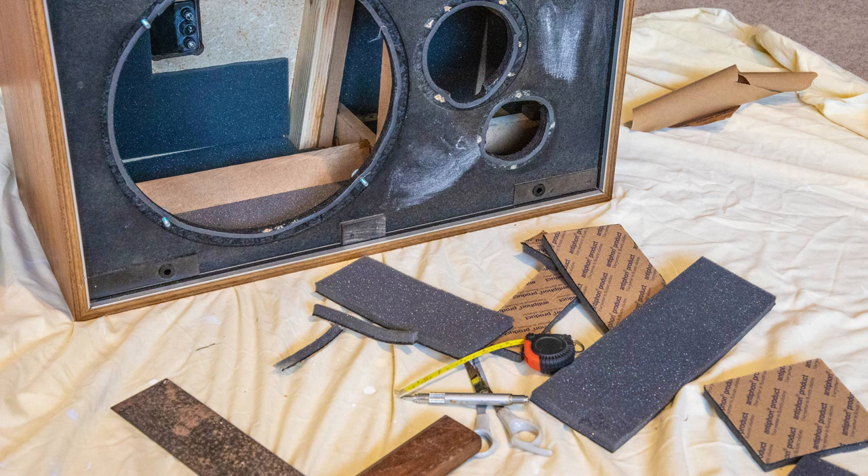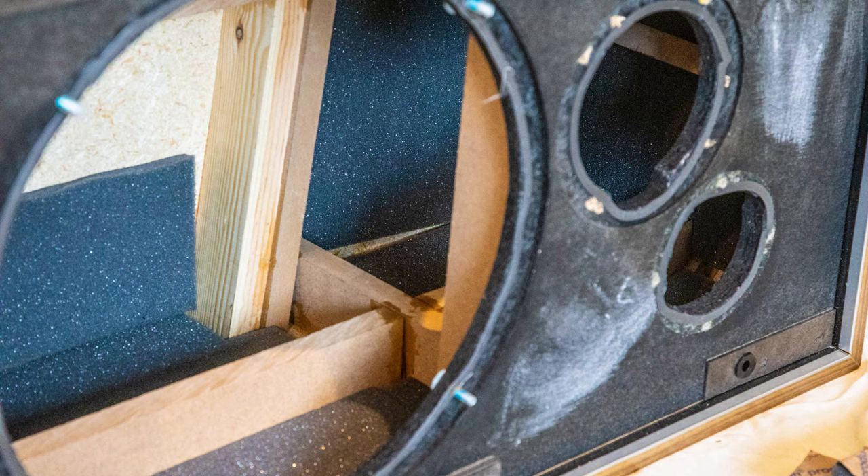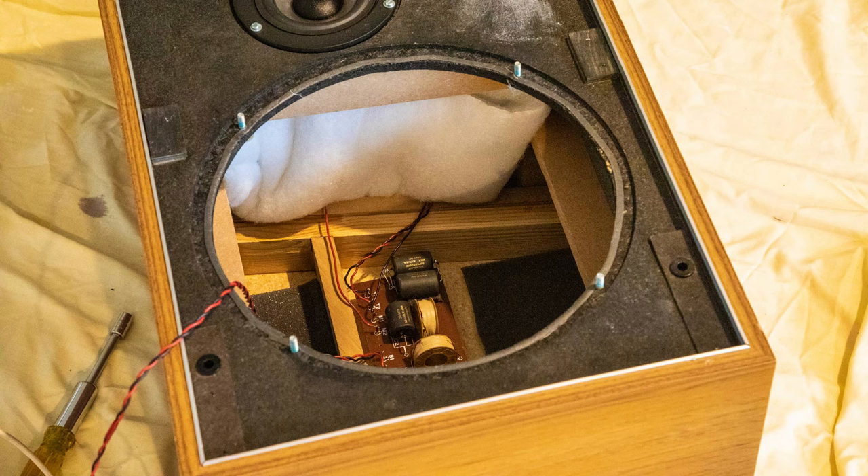Having fitted the bracing, I next fitted the sound deadening material. This had foam on the top, a bitumastic-style material underneath, and a self-adhesive layer at the bottom — similar to what's used in cars to stop panel vibrations. I placed the material around as many surfaces as I could. With all the vibration damping material in place, the empty space within the enclosure was filled with new sound deadening foam and all the speakers were refitted.